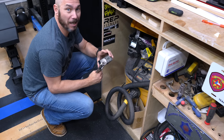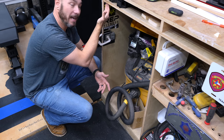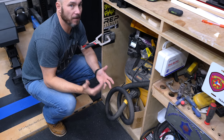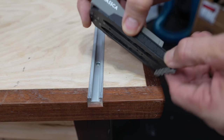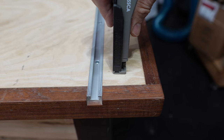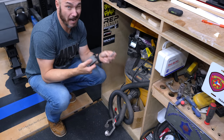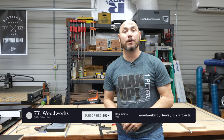How much easier would it be to just bring a small jig over, clamp it in place, and drill my pocket holes? I can get all the way to the edge with it, all the way down to the bottom. It's just more convenient and more ideal for getting into small places, especially if you forget to put a pocket hole somewhere. The great thing about this jig is you can actually remove this piece and get it flush up against the bottom of something — so if you forgot to put pocket holes in, you can come in later and flush it up to the bottom without worrying about the lip overhang that most jigs have. If you like these style videos, click that subscribe button and the bell icon so you get notified of all our new content.